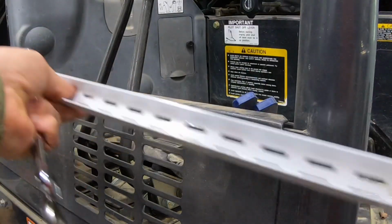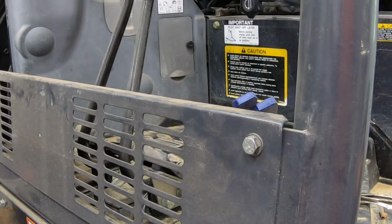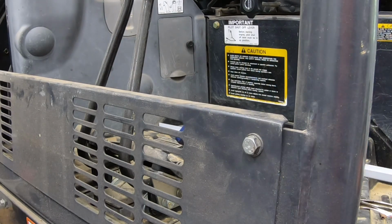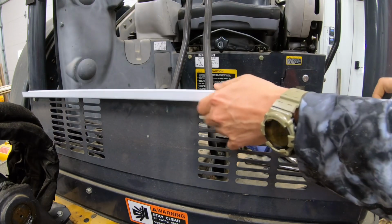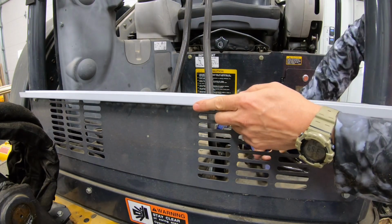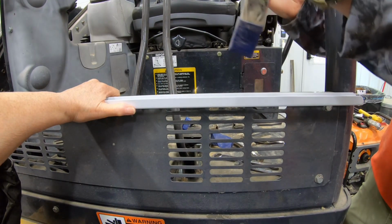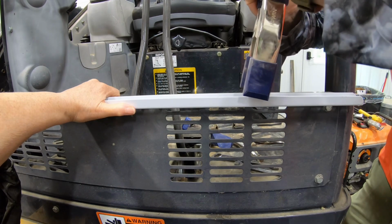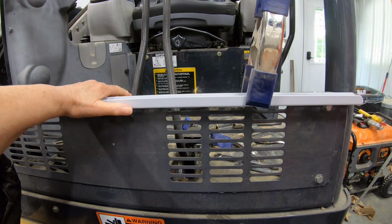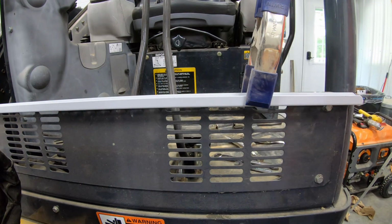What that'll do is this rail will sit on the flat of that and give it a little more of a shelf of support. Now I'll set my rail on top of those. Okay, with that sitting there, we'll see if we can use a spring clamp to hold these. Oh yeah, that's nice. Let go and see if it's, yeah, that'll hold it while I drill it, is my thought.